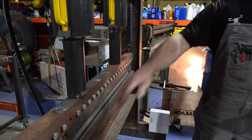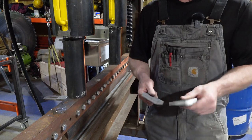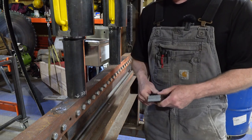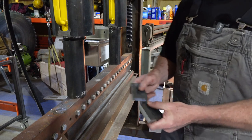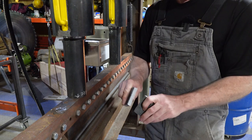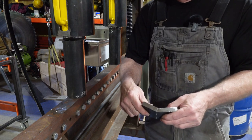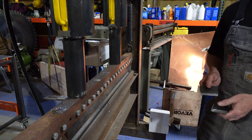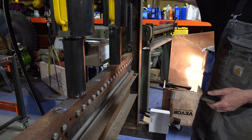All right. I'm going to have to mill all those teeth now and put them back in order. But we know that we're not going to try bending a piece of half inch on here. It's just too sharp of a bend for something. Had I put a diameter in here, you can make dies that allow you to do that with rounded surfaces, so you're not focusing all that stress. Here's how far we bent before the material yielded. Okay. So that's pretty good. It definitely has the power to bend anything I'm going to need to bend in here, anything that practically would be bent. So, all right, that's a win.